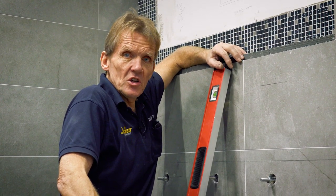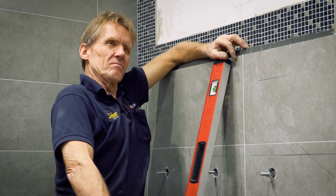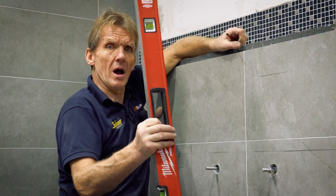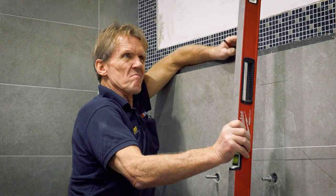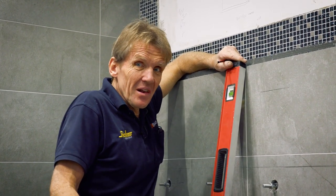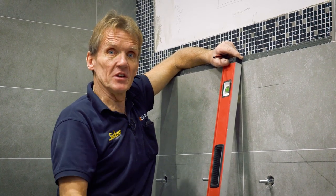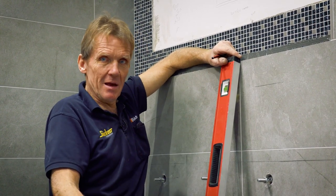After a week's work I'd got the extension built, then I looked at it in daylight and something didn't seem right. It was level enough that way, but it wasn't plumb — it wasn't quite upright — which is probably the worst thing you can have. I got my level out, put it on the wall, thought it looked plumb, then got another level and checked: it was out by about half an inch over the length of the wall.